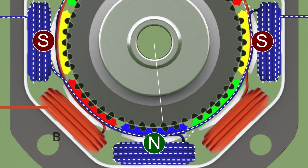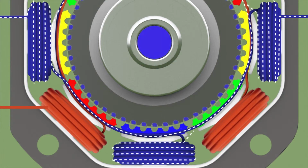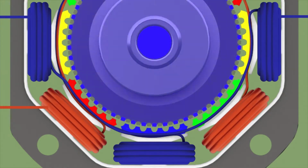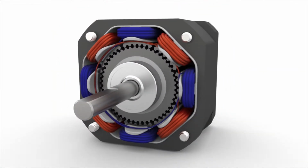Step angle resolution can be improved by half-stepping. It is important to know that the north rotor cup teeth are placed between the south rotor cup teeth. In this way, alignment of the opposite polarity poles is guaranteed again. So, this is the working principle of hybrid stepper motors. These are ideal for applications where precise movements and simple controls are needed.